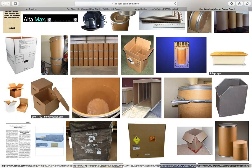And then don't stack bagged materials the same way all the way from the top of the pile to the bottom of the pile. Basically, what we want to do is taper in that material, or we'll go ahead and block it. If you look at figure 4, you'll see properly stacked bags, and it's basically called blocking them. And the same thing happens with brick and block, if you notice at figure 6 at the bottom. And basically we're blocking them.